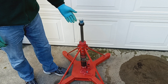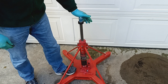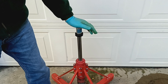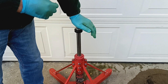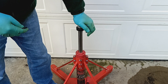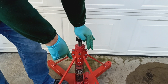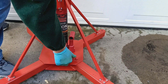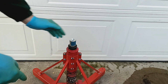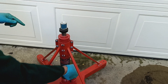What I wanted to demonstrate when I brought this thing home — I did not disassemble it. I just started fussing around with it trying to figure out what was going on. What I learned is that if I put a load on the jack — I'm putting a load on it now and you see that it's just collapsing, and it's not because of this valve. This valve is tight. I'm going to pump it up a little bit and do that demo again.